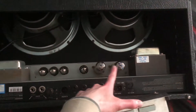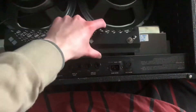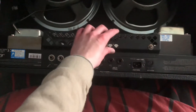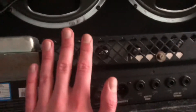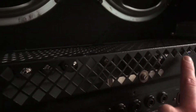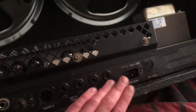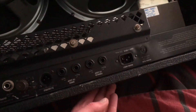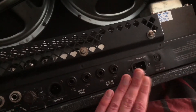These are the two power valves, these are the preamp valves, and it fits on like that — three screws. There's already a load of air around the valves. The preamp valves you shouldn't have a problem with, but the power amp valves here: normally the heat will go directly up into this area where all the circuitry is. These amps have vents to let the heat through, but it's still got to go through the PCB to get up there and that's not a good idea.